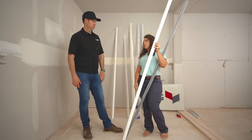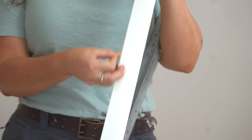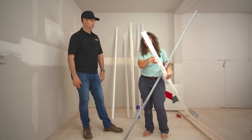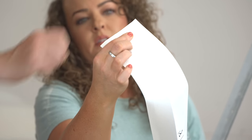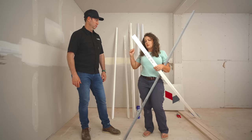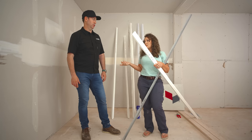We use this quite a bit, but there are downsides. It has a paper face — if you scuff it up, it's really hard to patch back. It will crack. If trim guys are rough and bang their trim on, it'll split up the bottom. There's a vinyl core in the center; if it gets busted, it'll crack right up the center. However, it's very fast — you can run it through a hopper and get 60 sticks on in an hour. It's fast to coat too since you're not covering as much. At four bucks a stick, it's actually cheaper than the metal.